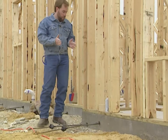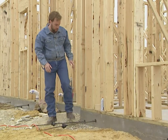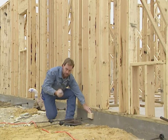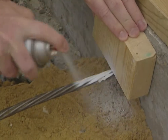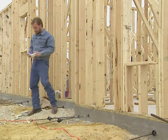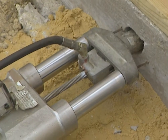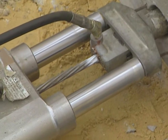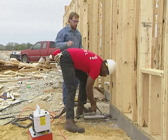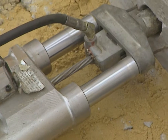The cable moves about one inch for every 12 feet. This foundation is about 45 feet across, so we're gonna have approximately three and a half inches of movement once we put tension on. To confirm that, we set a two-by-four against the foundation on a nail and on the cable and put a little bit of paint there as a marking point. Now Bobby comes in and puts some tension on it. You can actually see the hydraulics moving the cable out of the foundation. The engineer designed this one to cut off at 5,500 pounds on the gauge, which means about 29,000 pounds of pressure on that cable — a lot of tension squeezing that concrete together.